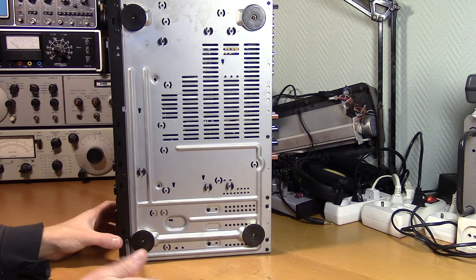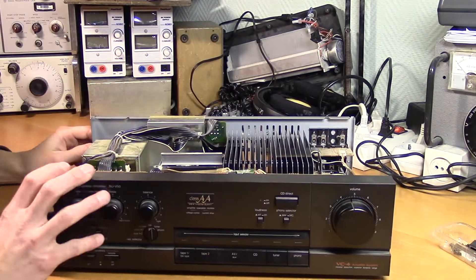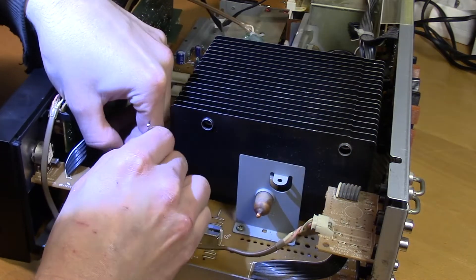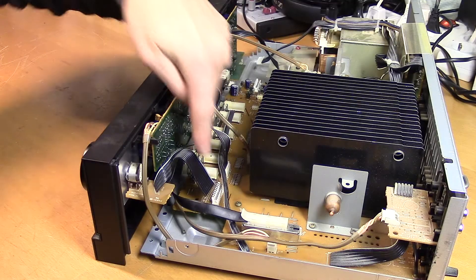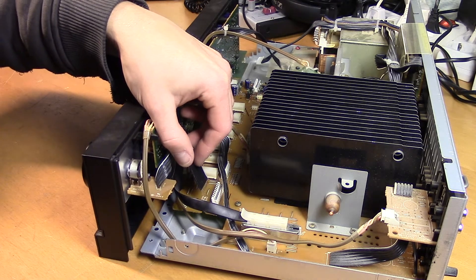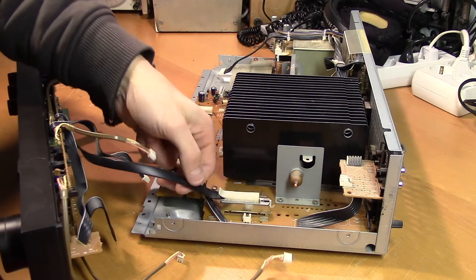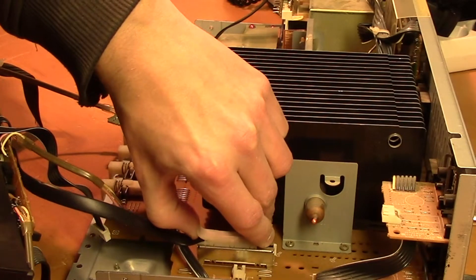Well, let's do that. These connectors are really annoying to disconnect — it's almost like picking a lock. You have to apply tension to the cable while picking each pin in the correct order, because you're only applying tension to one cable at a time. According to the instructions you should be able to pull it straight up — let's give it a go.